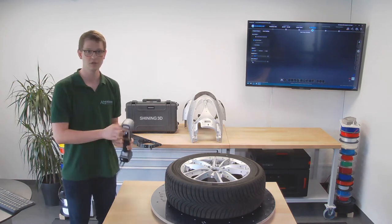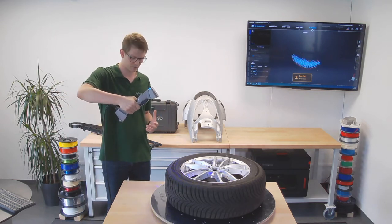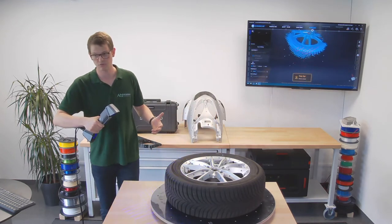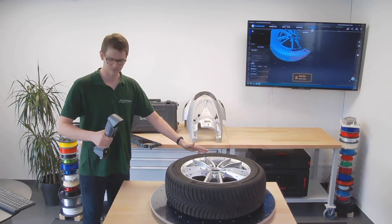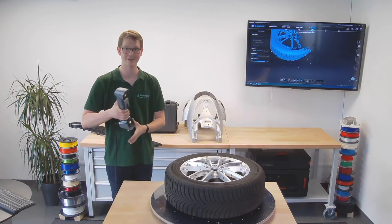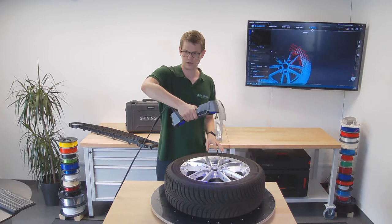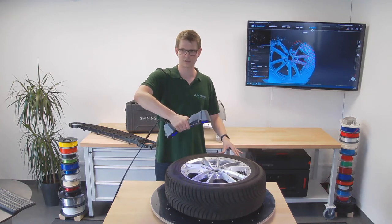I have my start button on the back of the scanner — I'll click it and that will let me start scanning. You can already see it's picking up the wheel and most of the inner area as well, but it's a bit finicky to really get it. The wheel itself, because it's not reflective, actually works very easily. Now if I change my setting over to reflective, which this inner area is, and start scanning again — pressing the button once enters preview mode, pressing it again starts actually scanning — it is far easier, quicker, and yields better results for this inner area of the wheel.